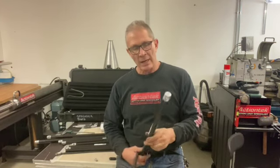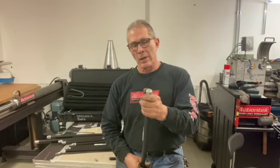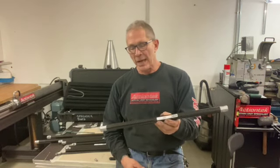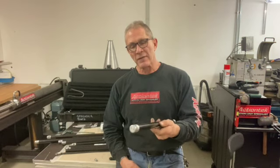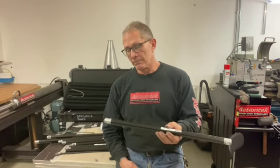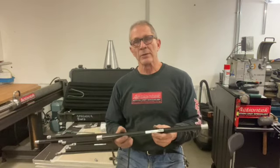I've said before — I don't like carbon fiber for everything. I use these primarily for performers or actor talent that is static, floaty, or things like that. Carbon fiber doesn't take well to getting bashed around. It's extremely strong, but impact-wise it has no plasticity — it does break. These are gel-coated so I can actually see if they've been dinged because the coating will crack. If they're flat or fabric you can't really see damage as easily.